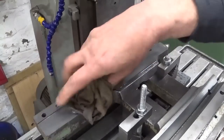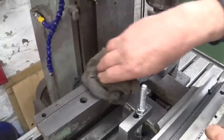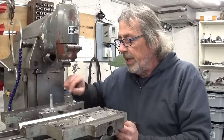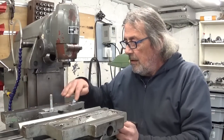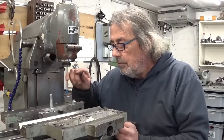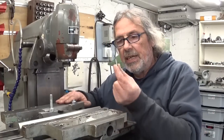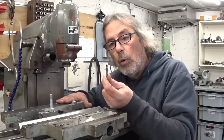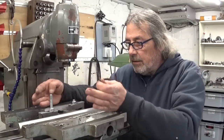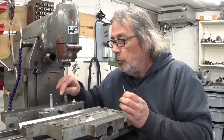I used coolant, which gives me a little better surface finish, and I think it was a good idea. I know you're going to tell me now that I should scrape this surface in to retain oil — and I am not going to do that because I hate hand scraping. Also because I have here a cute little ball end mill, and my idea is to install the part at a slight angle so I can cut a zigzag pattern in here to retain oil.